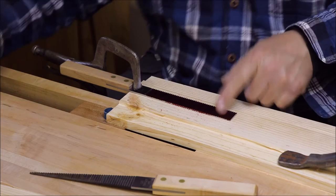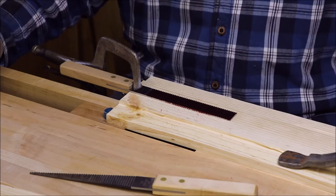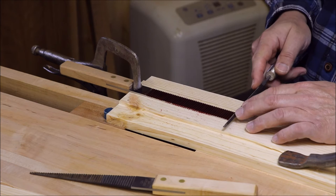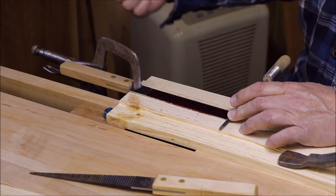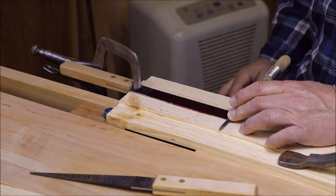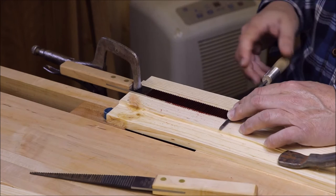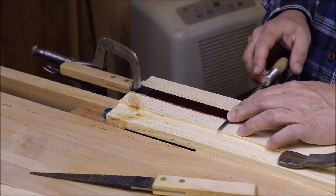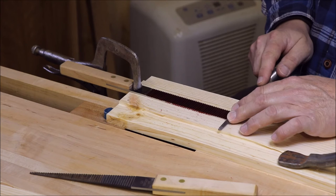You can certainly get your file in like so and get that front edge going, but what I do is I clamp this vertically in my Wilton metalworking vise and do that edge first with just a regular bastard file so I get that first edge nice and sharp. So that's already done — I did that before we started rolling. Once you do this, it's just a matter of following each tooth. It's very much, almost identical, to sharpening and refiling your rip saw for your handsaw, except that this is a much wider blade. Obviously the plate size is around 20 to 25 thousandths of an inch, whereas this particular one is a bed float — it's an inch wide. And actually, that is helpful to you because it helps you keep it nice and straight.